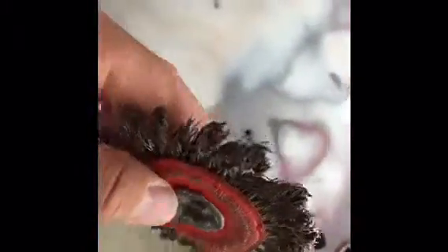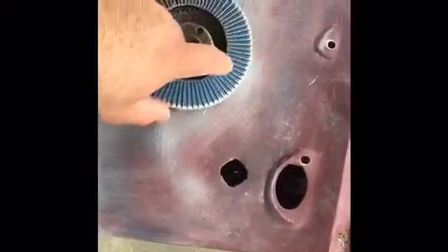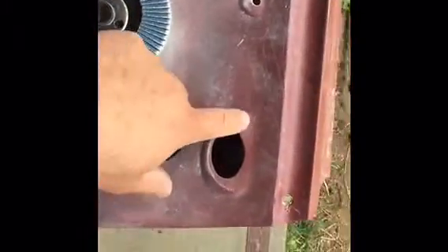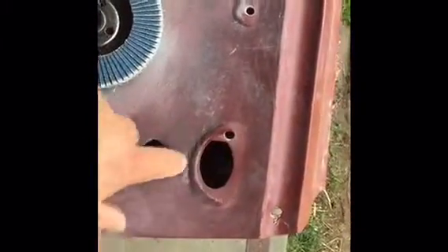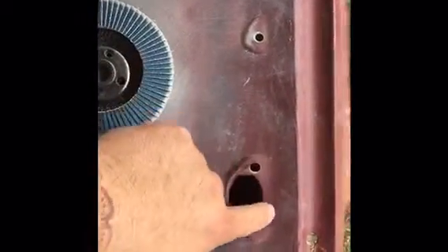When you're doing this, you need to clean the metal really good. You want to use this wire brush wheel. I do not use a flapper wheel like this. You can use it to clean the metal real good, but when you're grinding with this the metal is going to get really thin on you, and that's when your welding skills are going to need to be a lot stronger. So to avoid thin metal and welding problems with the heat, I'll just clean it up with a wire brush wheel.